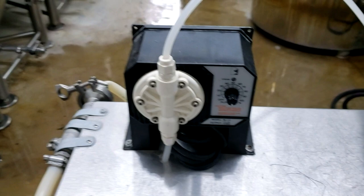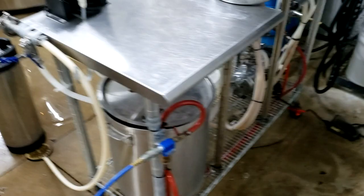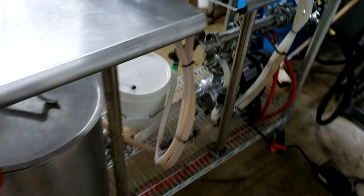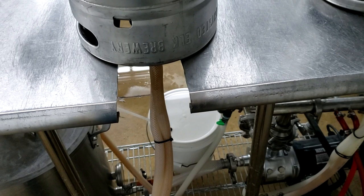The table is actually a stock stainless steel table I got from Sam's Club. I had to add a couple of supports in the middle, and I cut these notches out on the table using a Rotomax nibbler and a cutoff wheel, then ground it down nice and smooth so that the kegs fit. I've got six sixtels loaded here, but it easily does half barrels too.